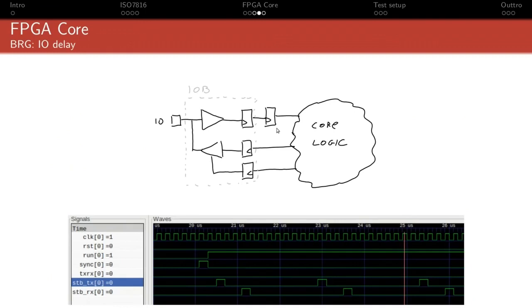So it is oversampling, because basically we are oversampling, except instead of being 16 times the baud rate, we just oversample at the system clock frequency all the time, which might be 15, 16, or if your baud rate is low, it might be oversampling by a factor of 1,000. It's just a kind of fixed frequency sampling. But as I said, this introduces a delay, and so you need to increment this, and that works up to a point. When you get to some of the higher baud rates at lower clock, if you are the clock master, that's still something you can deal with. But if you are a card or trying to emulate a card, that gets a little more tricky. And in some of those cases, I'm not sure we'd be able to handle them, at least with this core, I'd need some tweaks.